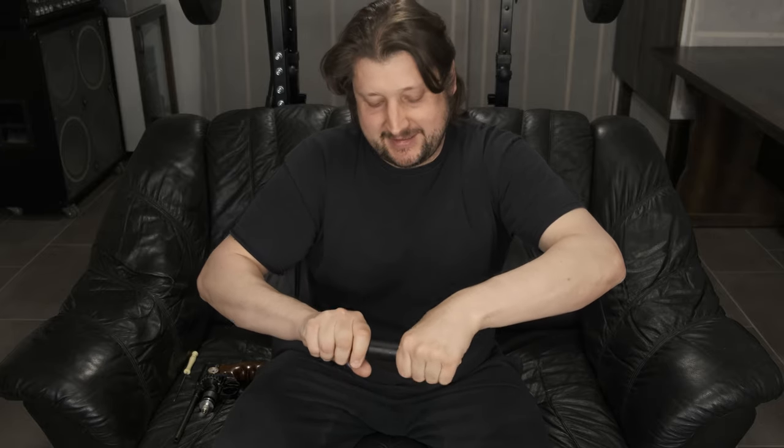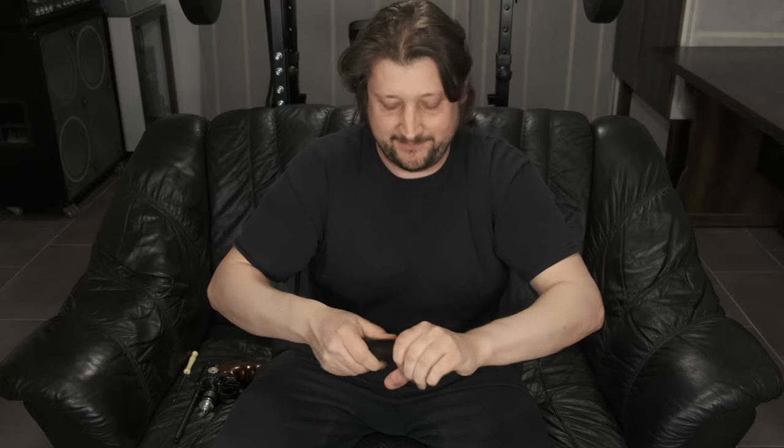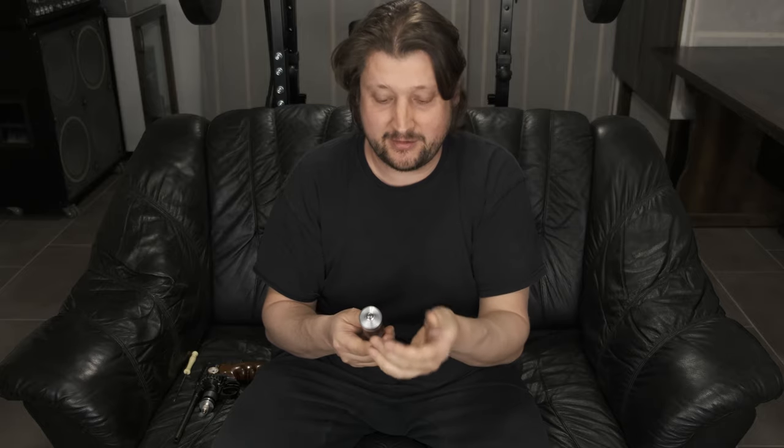So the thing I made different, of course, is that the original Huben end cap has a port for filling via Huben probe. As probably you guys, I prefer just to have the quick fill nipple. It's so much easier, you don't need any converters for different manufacturers, you can just have one, and there are no problems with leaking and things like that. And this works excellent. It does destroy the looks a little bit, however, I agree about that. But you know what, I'm willing to accept a little, let's say, less attractive gun for a little more practical gun, especially a lot more air reservoir volume.